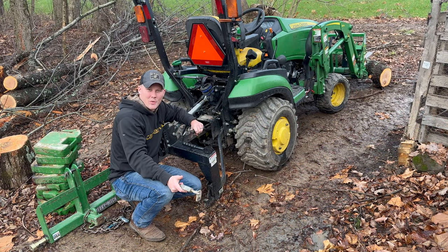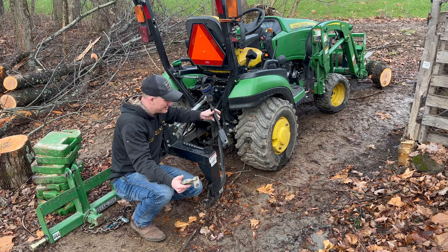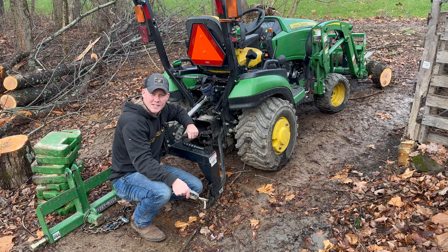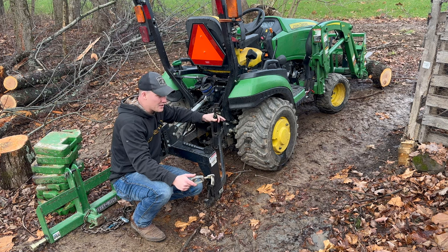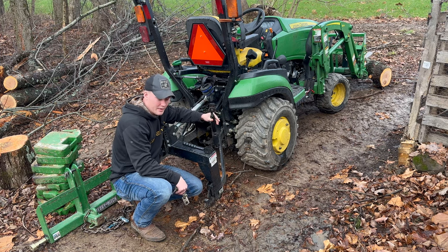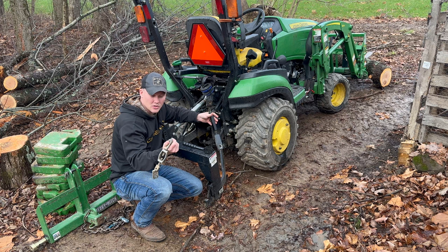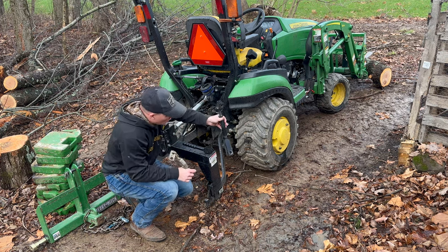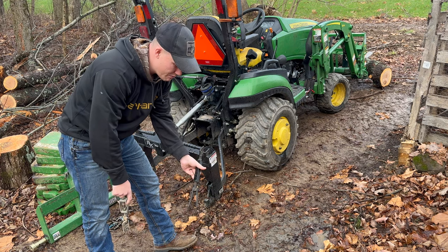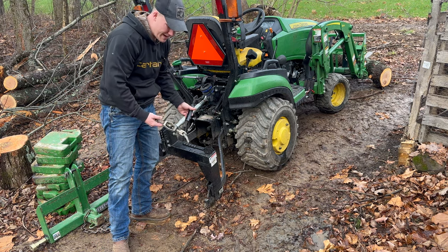Yesterday we were working out here — it rained this morning so it's a muddy mess. This video is going to be a short one, but we definitely wanted to bring it to you. Yesterday while hauling some logs out, the three-point hitch — all my ballast weight hit the ground. The sway link — I believe that's exactly what it's called — actually broke where the threads are. When that happened, it also bent the extending arm piece that goes on to your three-point hitch. We had to go purchase the parts from the John Deere dealer.